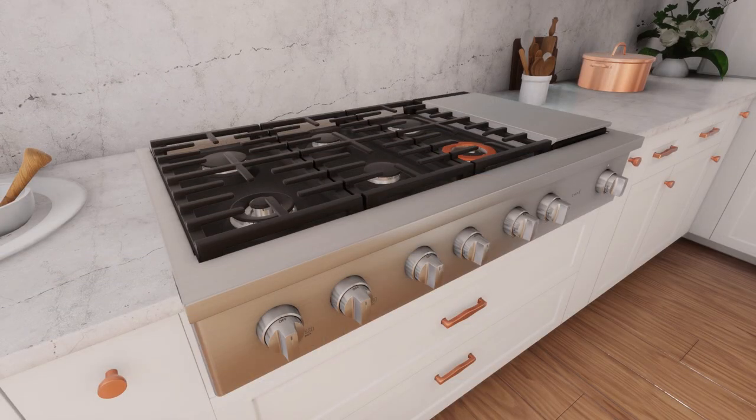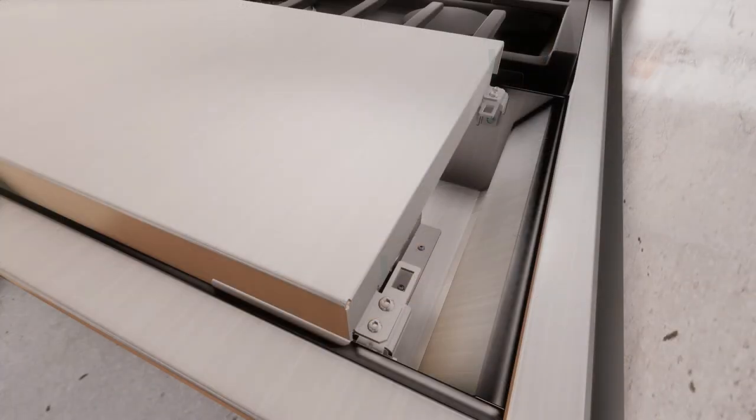To adjust and level the griddle, place the burner grates over the burners. The grates must be properly seated. Before leveling, loosen the 2 inner clamping screws located under the griddle rear flue cover. These screws must not be removed. Now, adjust the slope of the griddle with the 2 leveling screws under the rear flue cover. Then, adjust the griddle for a forward slope using the 2 outer leveling screws. These screws must not be removed.